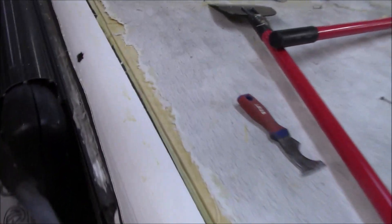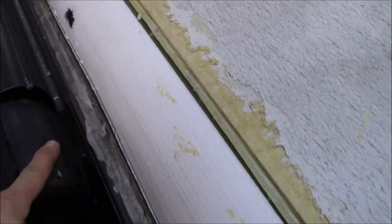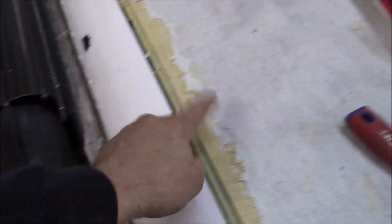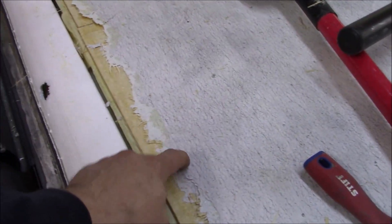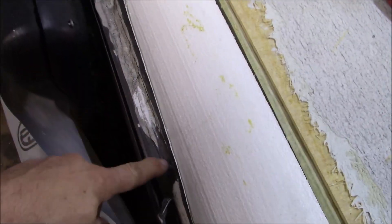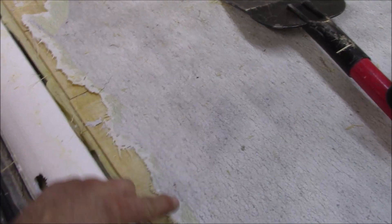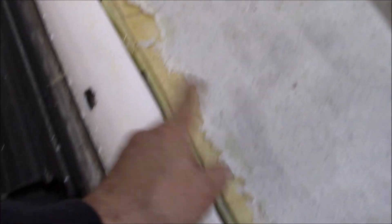Here's what I call a double whammy: there's your awning and it's actually still too low. Here's your patio awning — this piece needs to go up here. The awning rail needs to be up here. Then there's a gutter — it was like a gutter going into another gutter. Not good thinking. But this is how that foam ended up going in. We're going to bridge it up and put another awning rail on top to make it right.